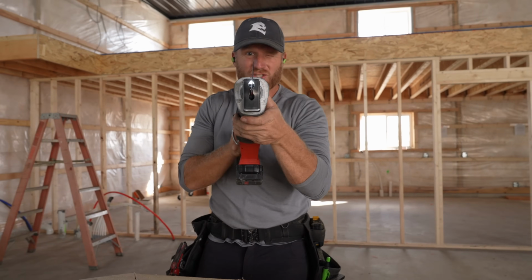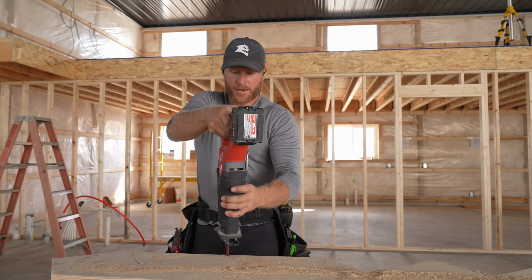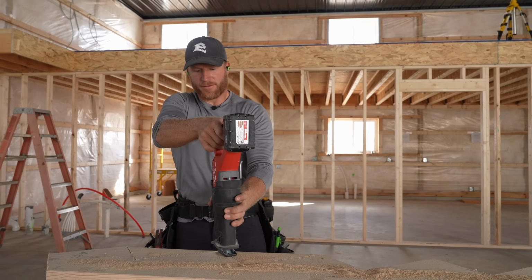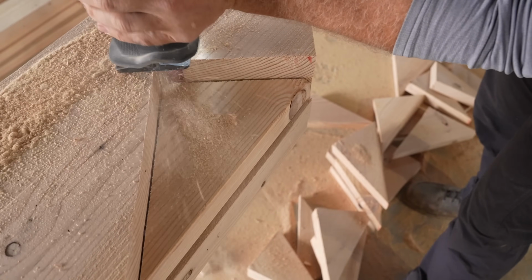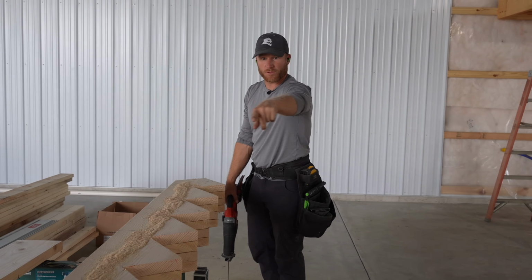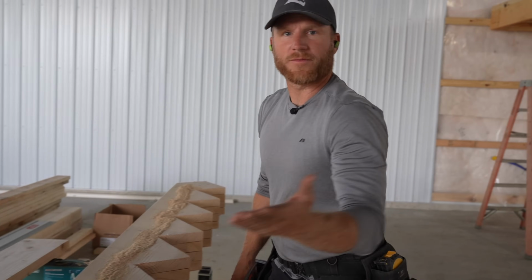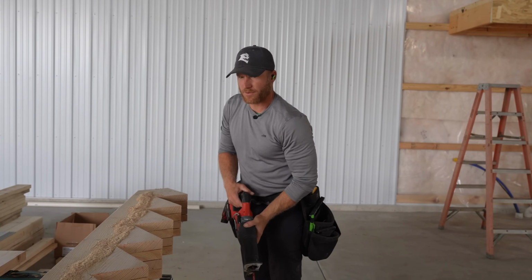Very important to have a nice straight blade. So throw a fresh one on when you're doing this. Otherwise, and don't push hard. Let the saw do the work. Otherwise your blade can walk on you, and then all this work to make nice, repetitiously similar stringers goes right out the window. Make sure you're going straight up and down. Those should be nice and consistent. Because we started with them flush on this side and that side, if there's weird things, which I think we kind of noticed that this third one down, it sticks out a little bit, but it can have a little bit of a different crown, because when it gets put on the ground and up against the landing, through the middle, it'll still be the same.